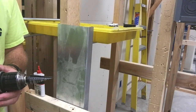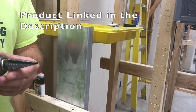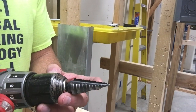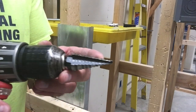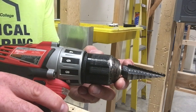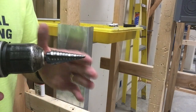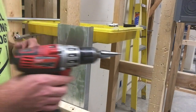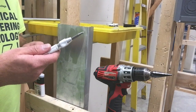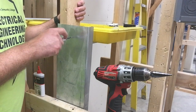One of the first ways to put holes in metal is to use a step-up bit. This can go in any common drill and you can see the different sizes you can go to — from three-eighths all the way up to seven-eighths. This is a lot like drilling any other hole; you just need to apply pressure. I'm going to use a metal punch here to help set it, though it's not required — it just makes it a little easier to start.